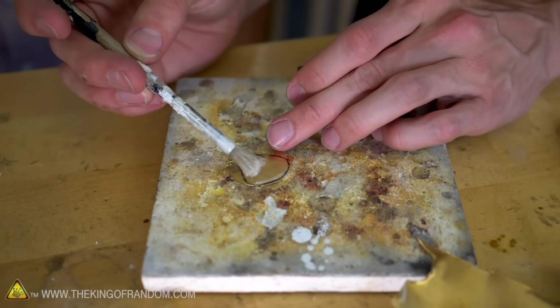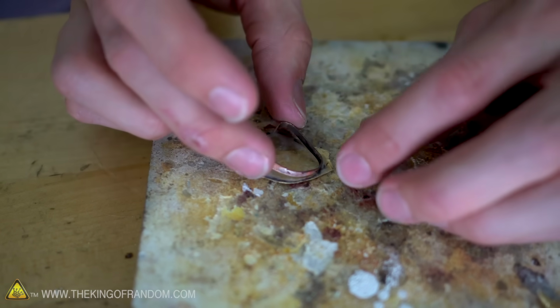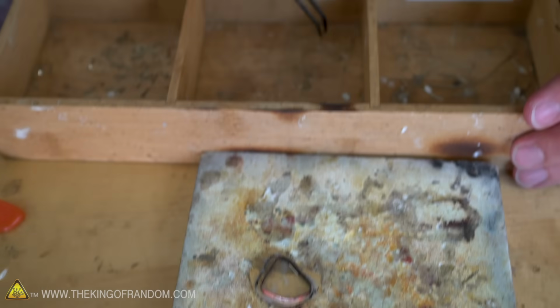So that means that on this solder, we're going to go ahead and use medium. And medium melts a little bit lower, because this way we won't melt the first solder joint, but it will still bond to the brass. Exactly. So we won't lose what we've already done. Right, so go ahead and just place the pieces along the line, sort of the line inside.